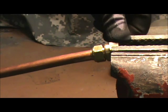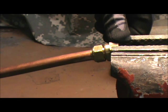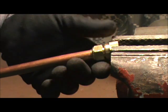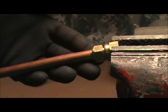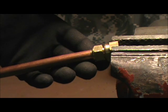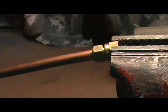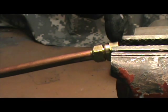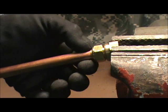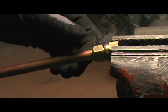Your tubing is fastened to whatever your device is, even if it's a coupling. These come in a multitude of different fittings. This can be used for water. I don't think they use them a lot in gas, but if you run across these and need to reuse them, you have to cut the tubing off and buy everything new except for the centerpiece. You can back the nut off, buy other ferrules and put them in there, but you've always got to cut the tubing off and start anew.